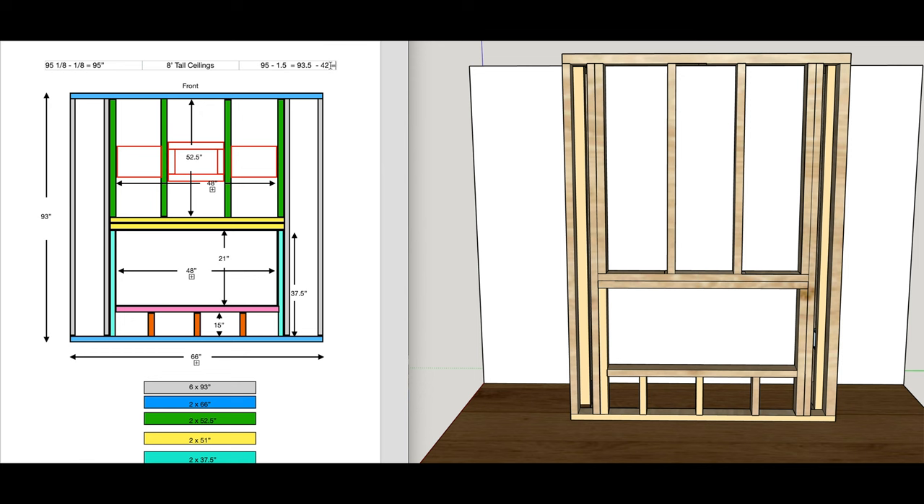One other thing to note: you'll need to add an outlet box inside the framing so your fireplace has something to plug into. Ideally it should have its own dedicated 20-amp circuit. If you're not comfortable doing that, hire an electrician. If running a new circuit is impossible, you may be able to branch off an existing one depending on its amperage, but since the fireplace uses a decent amount of power, aim for at least a 20-amp circuit.